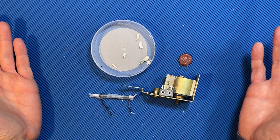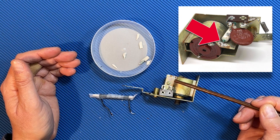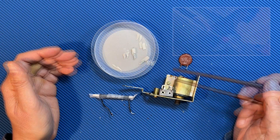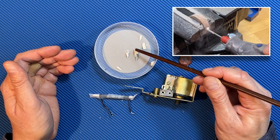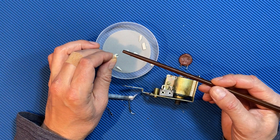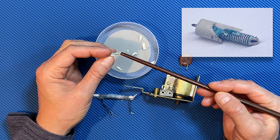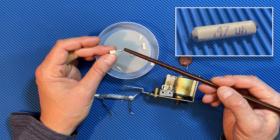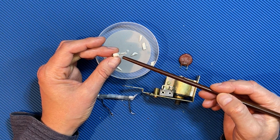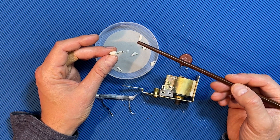Here's our motor assembly — or what's left of it. It's actually not as bad as it looks. There was an inductor attached to the terminal strip which appeared corroded, and as soon as I attempted to repair the corroded leads they broke right off. I made an attempt to repair the inductor by Dremeling off the end to access the leads — I successfully revealed the lead on one end, but on the other the corrosion had gone right into the coil and corroded inside. This coil is useless. The coil is a 0.47 microhenry inductor, so I'll have to find a replacement — but an inductor is nothing more than a coil of wound wire, so I thought: what if we make our own?